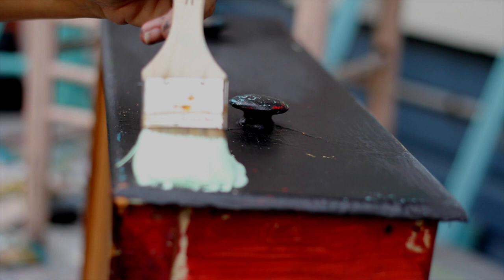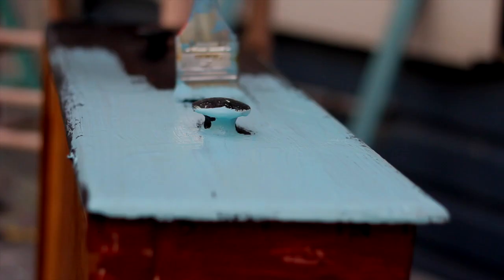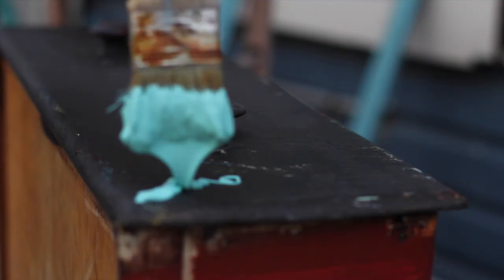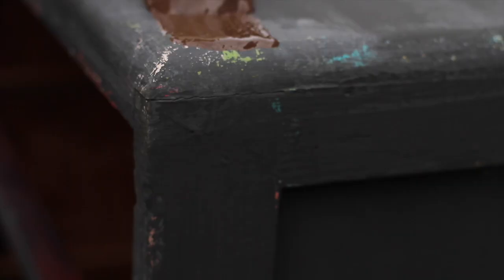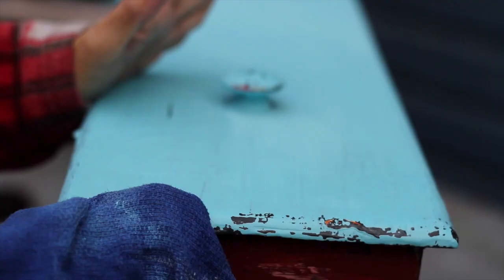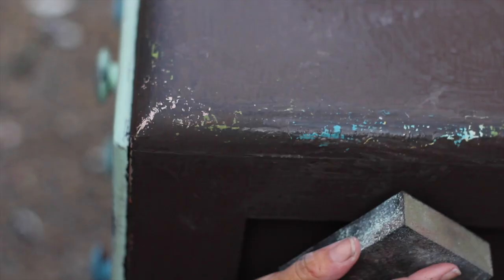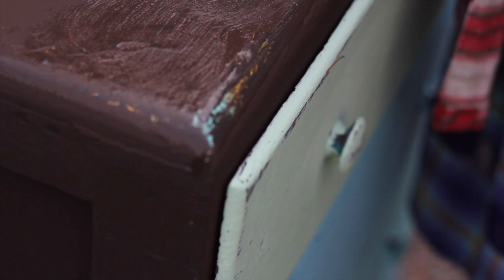I wanted to see if I could get a softer look while keeping the layered effect, so I painted four shades of blue on the drawers and Layered Chocolate on the rest of the dresser. DIY paint is highly pigmented so it's easy to cover up black with a pastel color. Then I began to rub the paint back again — this time I was really happy with the way the color came through. I used a damp cloth in some areas and a wet sanding block in others, and finally finished the project with clear liquid patina.